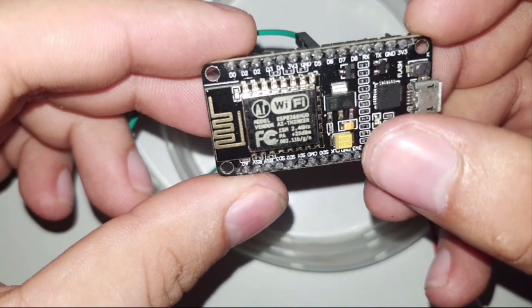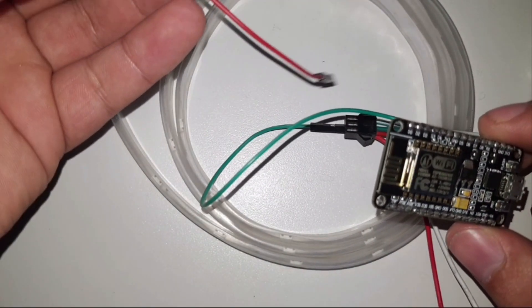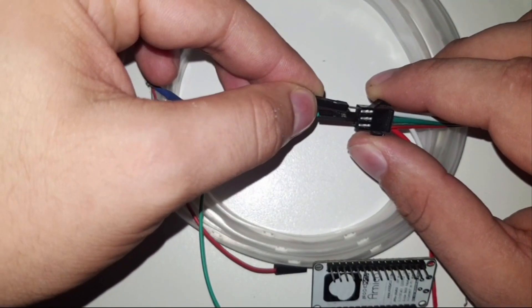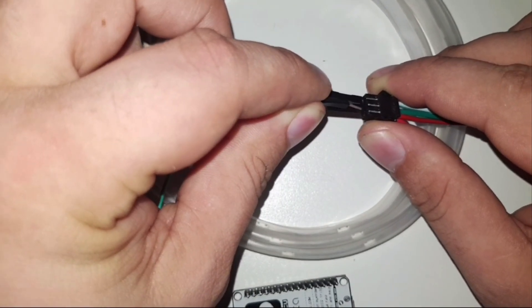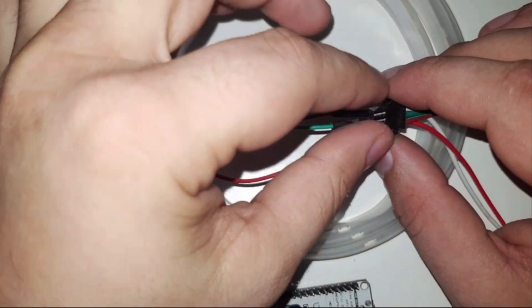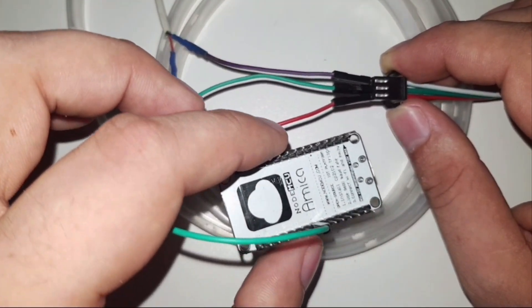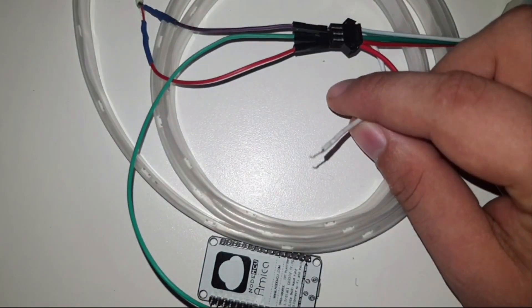D5 is plugged in. One more thing: with the power coming from our power supply, we also need to plug the ground wire to ground on the ESP — remember, that's the white wire. Then plug the power cable from our USB power supply into the 5-volt power of the LED strip. We also need to connect the ground of the power supply to the ground of the ESP itself, so I'll quickly add a Dupont connector onto the white wire and connect that to ground as well.